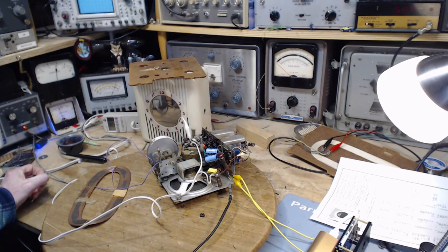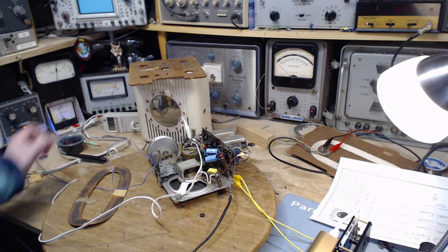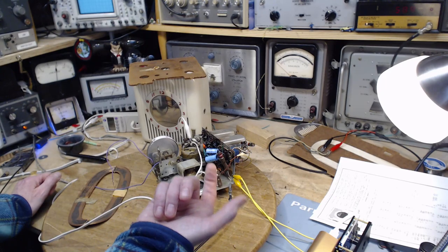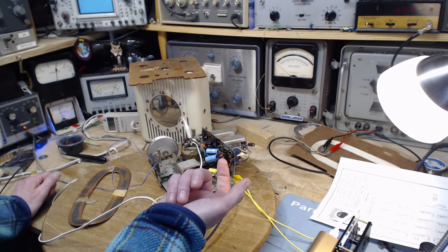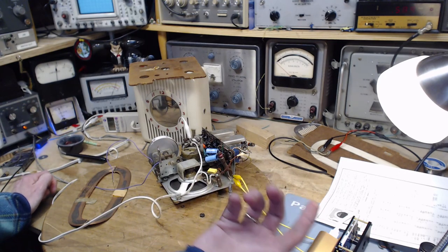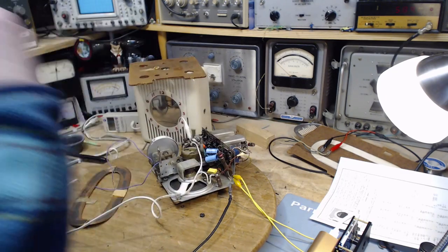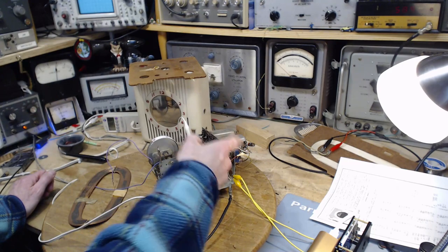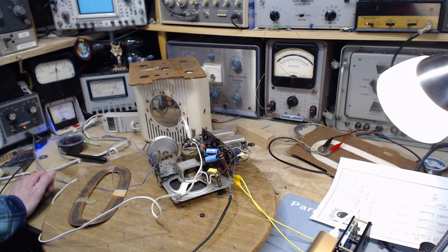They're all suffering because this resistor is a replacement. Now, why would he pick 33? Did he not look at the schematic? This could have been done long enough ago. Didn't have the schematic. Pulled out this, it would have been a burned open resistor, I'm guessing. Can't measure it. It's a weird resistor, he may not have realized. And he just knew, generally speaking, you put a high wattage one about 50 ohms in there, he dug a 33 out, stuck it in. But he should have measured the drop on it. Should have measured the drop, and known he'd missed.